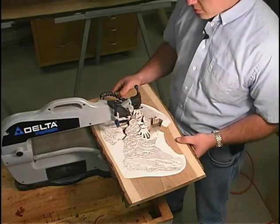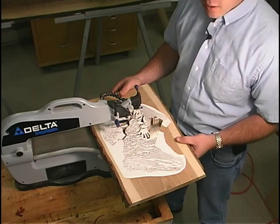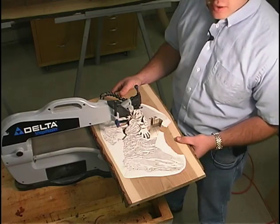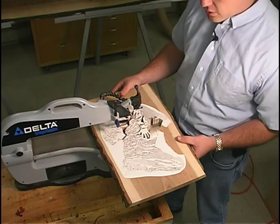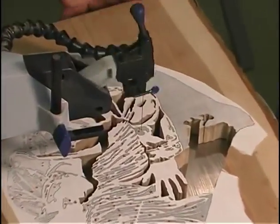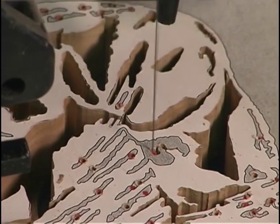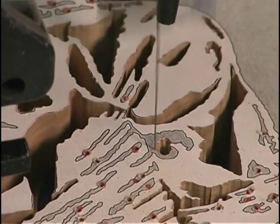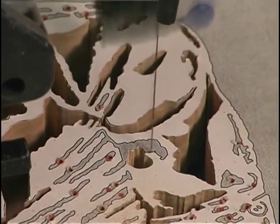Now that we're ready to start cutting, this scroll saw has a variable speed. If your saw has variable speed, I encourage you to start off at a slow pace — if you accidentally drilled your hole a little crooked, it allows the blade to slowly cut itself and work its way back to perpendicular to the slab. It'll also prevent you from breaking blades excessively at startup. We're using a number one spiral blade. Start it slowly, then gently increase the speed. We're going to go around the center of this cutting just to show you how versatile the blade is — you don't have to turn the piece, you can simply go around in tight circles. You'll notice that on some pieces, they'll actually pop out and come right at you, so don't be surprised.